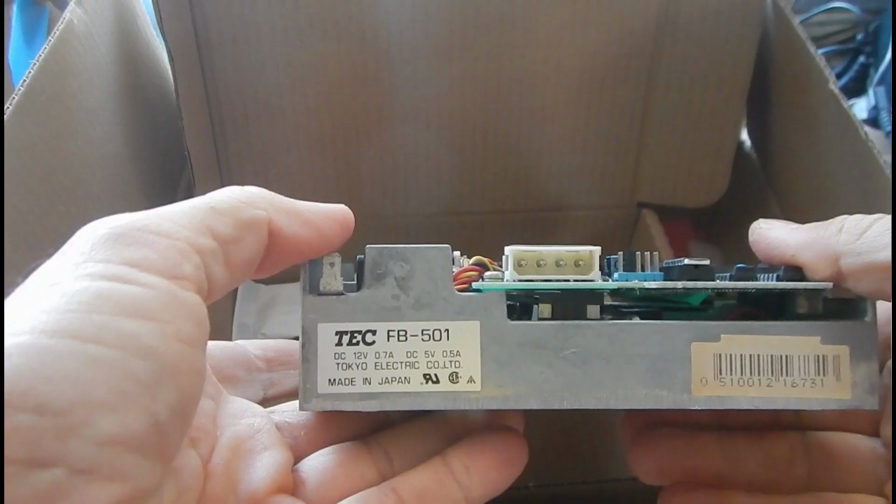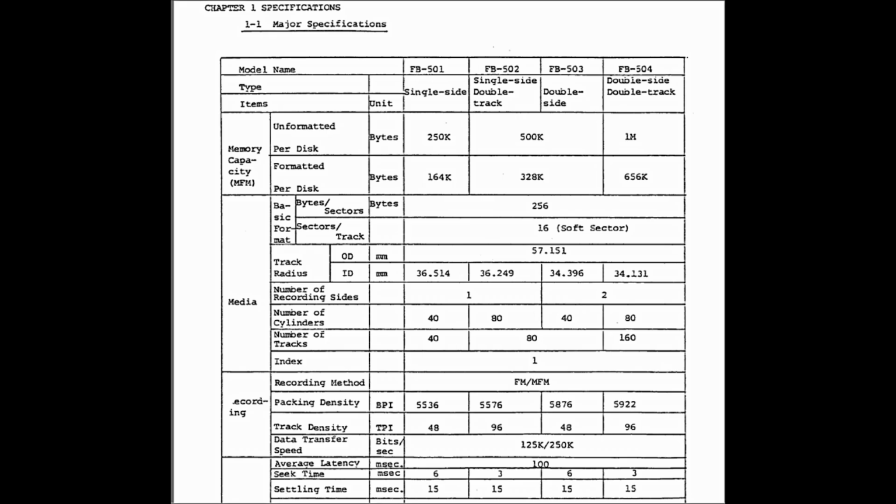I wasn't really looking for any particular drive brand or model. I did, however, look for a single-side 48 tracks per inch drive to make a 2031 compatible unit. I could, of course, use a dual-side drive with head 0 permanently selected, but the real single-side drives are usually more reliable. Another very important thing is being able to find the service documentation for a drive we want to play with, because I was sure from the beginning that I would need some hardware modification of the drive electronics.